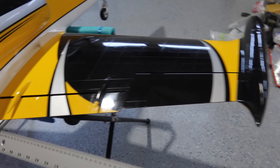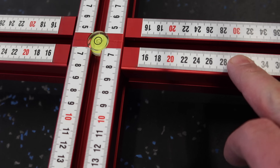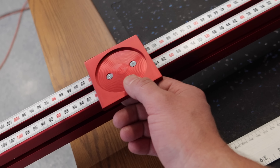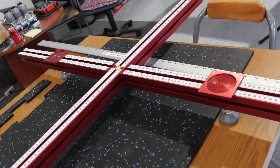So then what you do is take the big ruler and measure in between the mains. What I got when I measured that was 650 millimeters, or 65 centimeters. Then you come to the ruler here - now if you look at this ruler it just doesn't make any sense, but it's already pre-done for you. So you know the distance between your mains is 65 centimeters, so you bring this puck edge to 65 centimeters right there, and then you bring this one to 65 centimeters as well. The metric system is great because everything just adds or subtracts a zero - 650 millimeters is 65 centimeters.